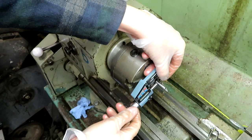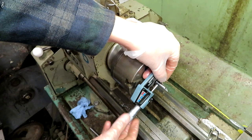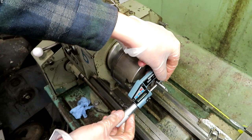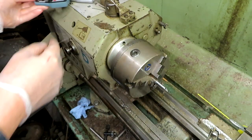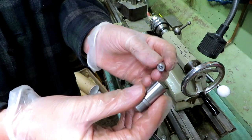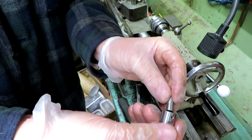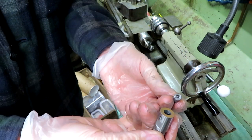Okay, I've finished all the turning. Let's just give this a check — this should be the same size as the bore of our collet chuck which is about 8.2 millimeters. We've got 8.213 — let me try that again — 8.208. So we're in the ballpark. So I've got our two parts that have to go together. What I've actually done is run this in the lathe a little bit and using some emery cloth I've put a slight taper on it so it is just slightly smaller at one end, hoping that might help with our press fit.